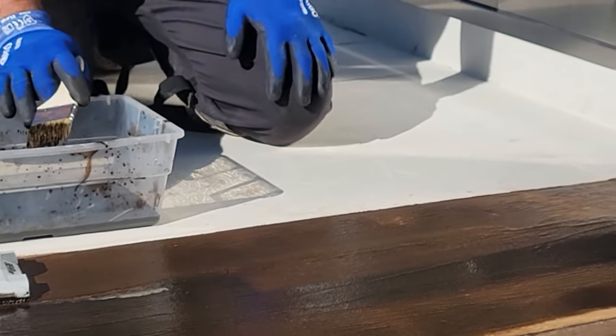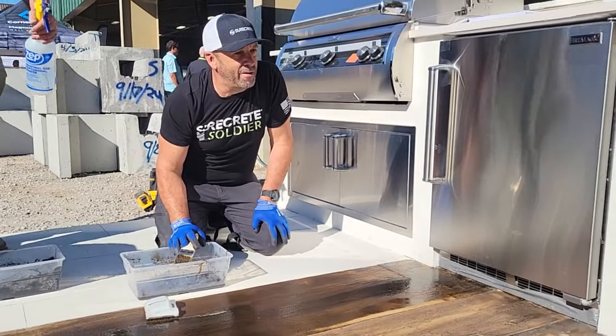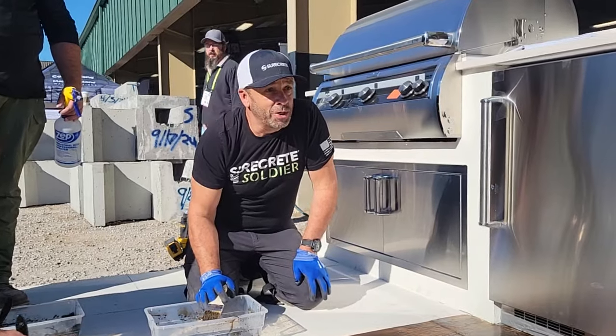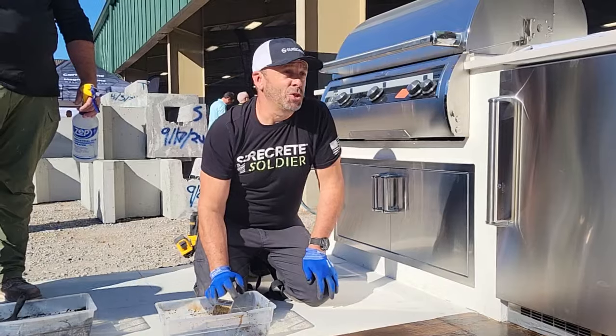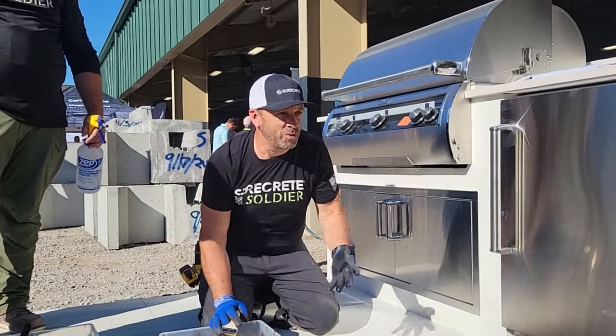Sorry, I missed that about the light, but the plane flew over. How's the light? Oh, yeah, so most guys that are doing these kind of overlays, especially around pool decks, patios, non-vehicular, if it's maintained properly, it's going to last 15, 20 years. That's constantly resealing? Probably resealing every 2 to 3 years, yeah. Depending on, where are you from? Connecticut. Yeah, so Wisconsin, same thing.